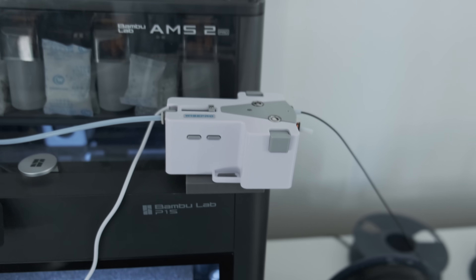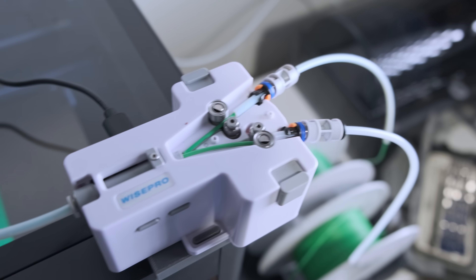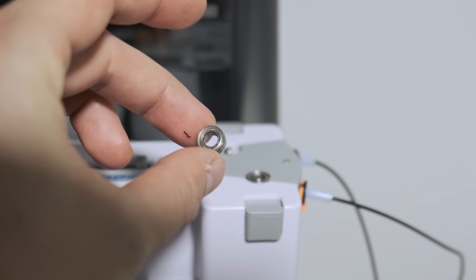Once I had that figured out, I also realized there's no way to know if you've actually loaded the backup spool properly — there's no indicator light, there's nothing. So when I thought I had loaded the backup spool, when it came to actually needing to use it, the whole print failed. Epic fail. Then it started to glitch out completely and thought the backup input was the primary input, meaning it tried to force the filament into a tube that was already full, jamming everything. And throughout this entire process, the bearings were trying to pop out every five seconds. The longer the print went on, the more they crept up until they eventually popped out — and when they did, there was no way to feed the filament and the print failed.